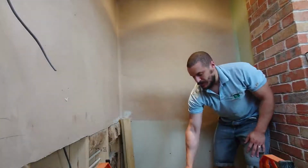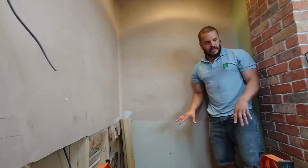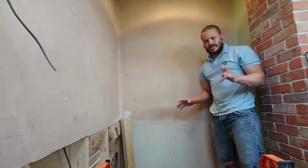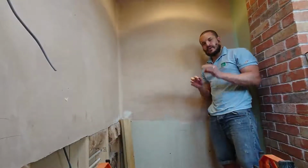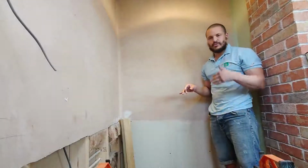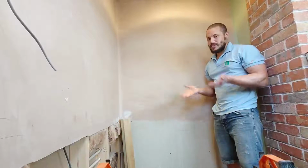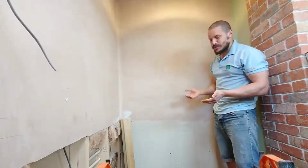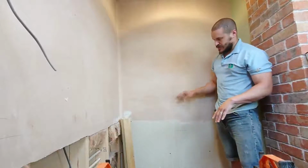So I'm going to crack on. First thing I'll be doing is measuring the space. I know I've got my floor built up over here. I know I've got my shower tray, which I think is around 22mm. I'll double check. And then on top of that, the tiles, which I haven't quite set yet, but it's going to be at least 10mm. So add on 10mm, a few mil of adhesive underneath. So we're going to be a good few centimetres off the current floor that I'm on at the moment. So I'll be able to work out roughly what height I need to be.